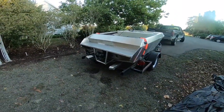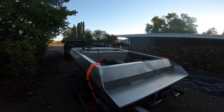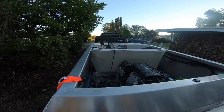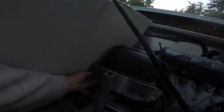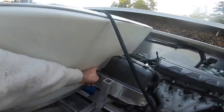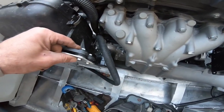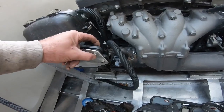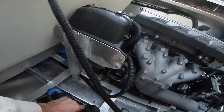It's still running in L-mode — low RPM or low power mode — and I'm really curious once it gets past 10 hours and comes out of L-mode. It seems to run pretty strong. But look at this — I've got a bolt hanging on my air box mount, definitely rubbing. The nut backed off — they weren't lock nuts. That was hardware I was supposed to get stainless for and change out. I'll need longer bolts with lock nuts. Had a little back-off situation there, so I have to rectify that.